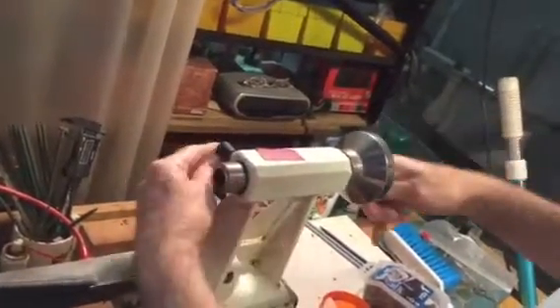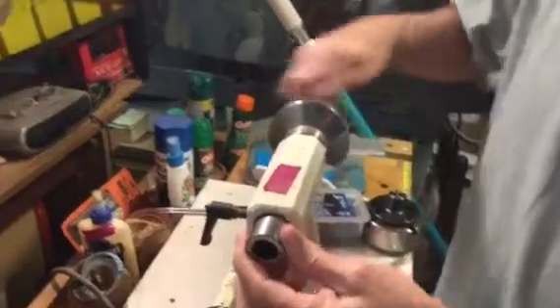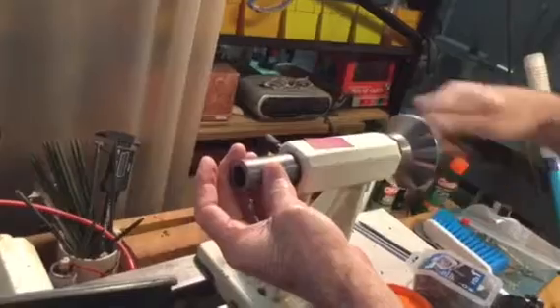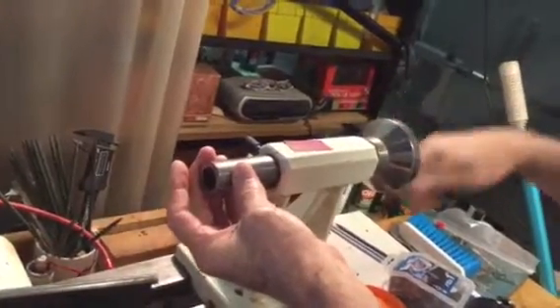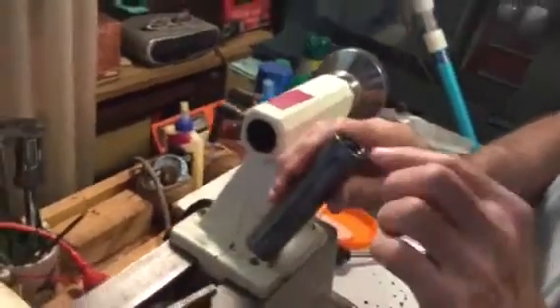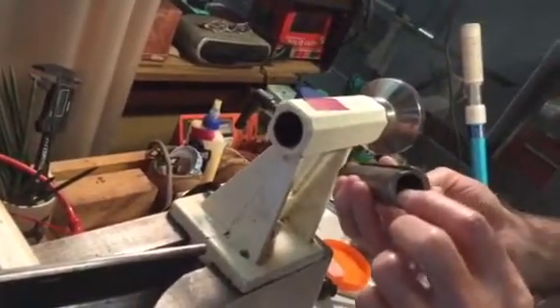That quill needs to be taken out every once in a while. To take it out, loosen up the set screw here, hold it with your fingers, then turn clockwise on the tailstock hand wheel — that ejects it completely from the whole system. You can see the female threads in here and this groove that runs along here. It's a good idea to lubricate the lead screw that's inside, and the threads here, and clean your Morse Taper occasionally.